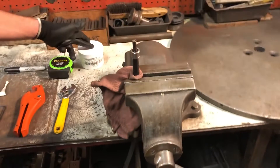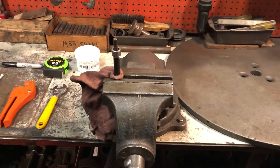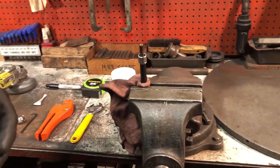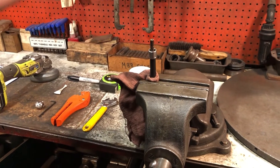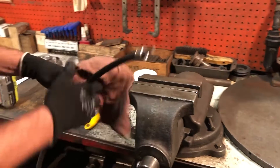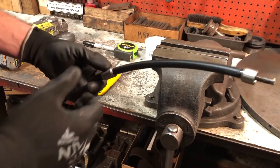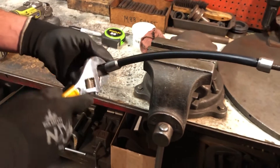We also have flexi-rooter lube on hand in case the shaft is dry at the location of the repair. To do the repair, the first thing you need to do is identify the location of the break. In this case it's pretty obvious it was at the end of the shaft. If the break was anywhere within the flexible sheath end or at the end of the shaft, the first order of business is to remove the flexible sheath end assembly.